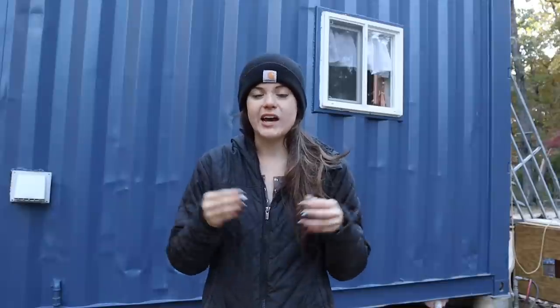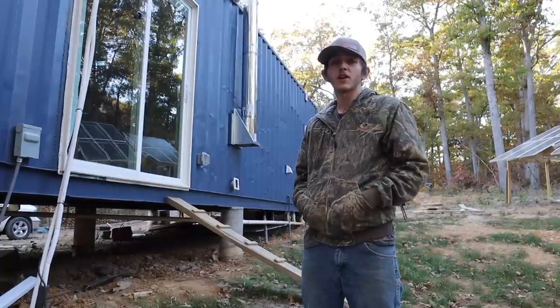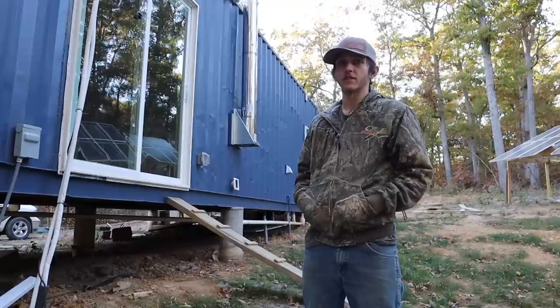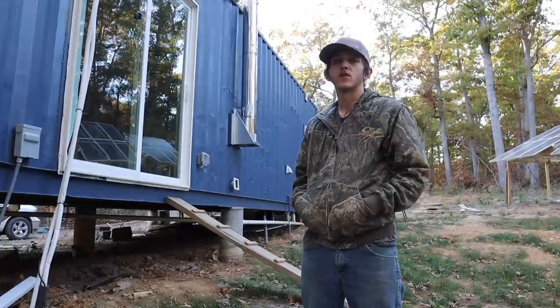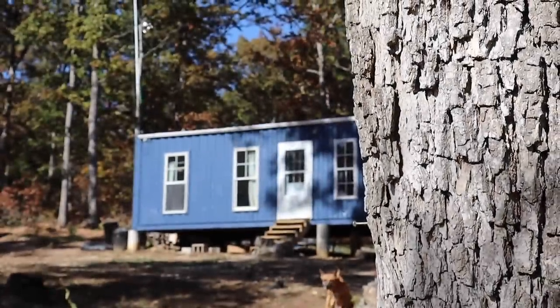I contemplated if I even wanted to show y'all what he's doing right now, but our channel is based on real life, and sometimes real life things happen — like forgetting to do stuff. Something that slipped our mind was our P-trap in the bathroom. Because we have a shipping container house, it had to be placed outside, and we forgot to insulate it. We're going to build a removable insulated box to go around that P-trap when we insulate the floor next week. For tonight, a bucket and some really good insulation will do. As for the rest of our drain pipes, as long as there's no clog, there's nowhere for water to stand and accumulate, so it won't freeze in the drain pipe.